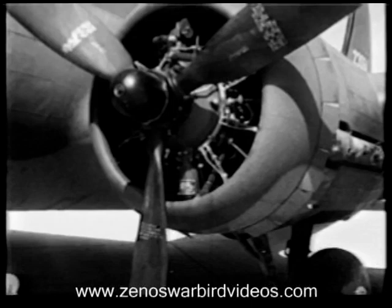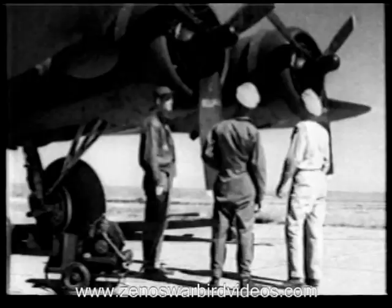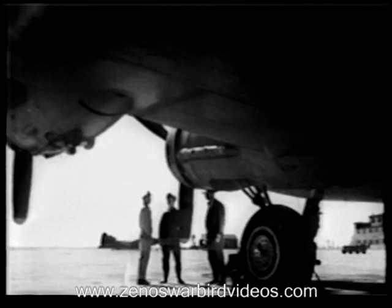What for? To make sure there's no oil getting out, I guess. And to see that those control cables are snug. Check. Take a glance at the engine, too. Sometimes things get wedged between the fins of the cylinders and prevent your engine from cooling properly. All right, check number 1 engine, turbo, and prop, just as we did number 2. Okay.